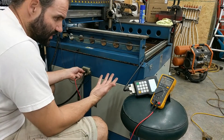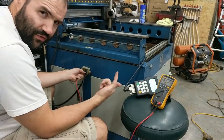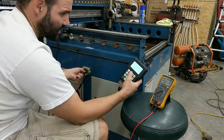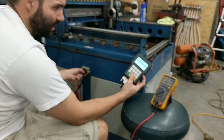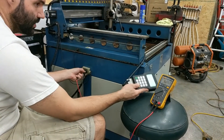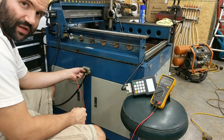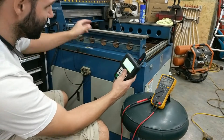The other thing I noticed is it takes one cycle for the computer to recognize that it got plugged back in. The way to handle this is you just run both axes in a little bit and then hit home. Home all. You saw it hit the sensor and then did its little shutter where it centers. Now everything's working again.